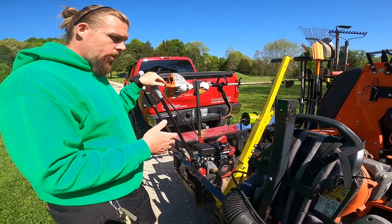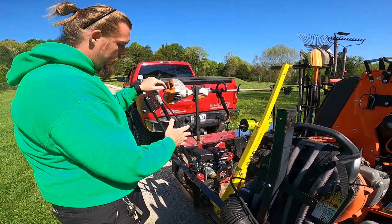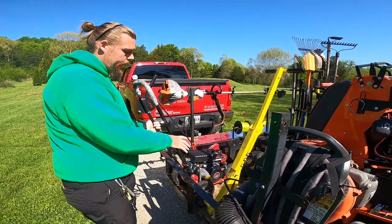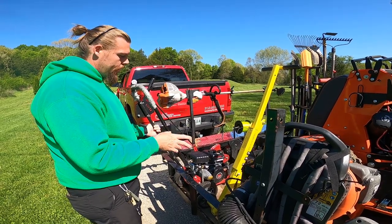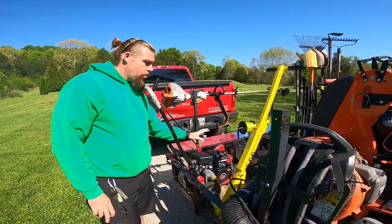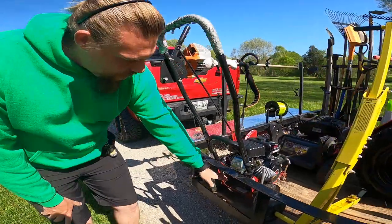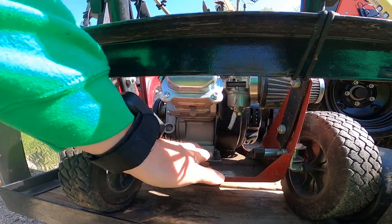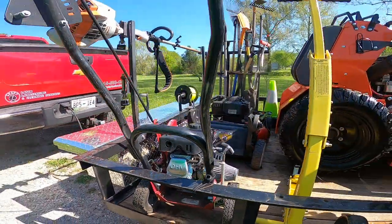One of the other things that's really handy is our edging machine. We do have one that runs on the trimmers, but for efficiency and a little more horsepower, this one works great. The chassis is actually a Craftsman unit that had a super old 1980s four-horse engine — old style traditional long barrel carbureted — you can't even get parts for them. So I went to Harbor Freight, spent 150 bucks, and got a brand new three-and-a-half horsepower engine to put on here. It has a fabricated plate to mount a smaller block where a five-horse would traditionally mount.